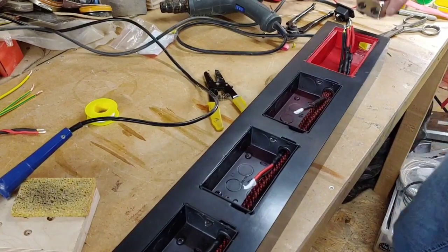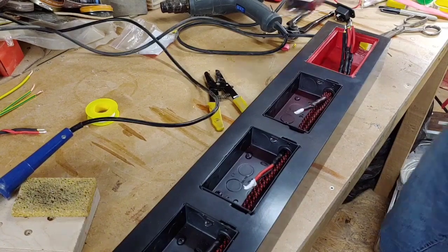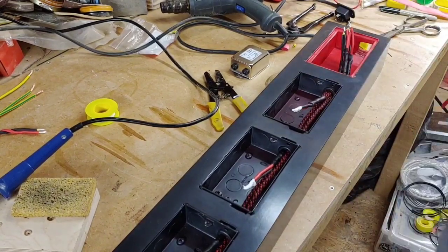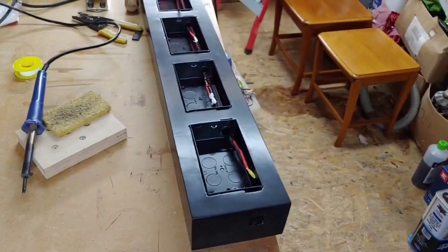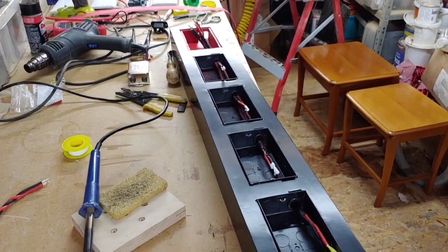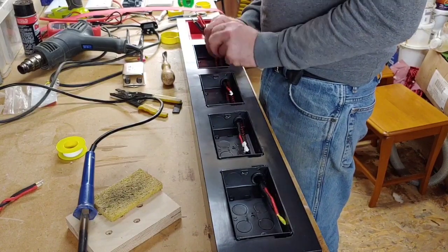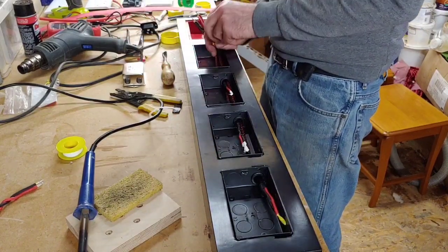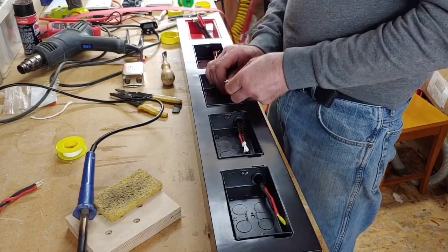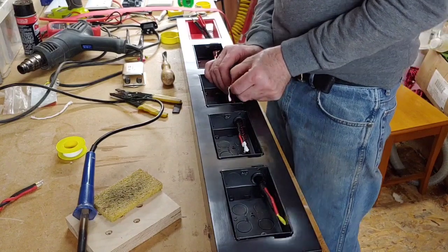Right, so these are all ready now to solder onto our terminals there, our neutral and our live, so our negative and our positive. Okay, so let's push all this back through now. I'm going to move the camera back down the end here again so you can see what's going on down here. There we go. Let's take off our PTFE tape here and reveal our conductors. Now we want to solder the ends of all these, so all of the different size conductors are all nicely connected to each other.